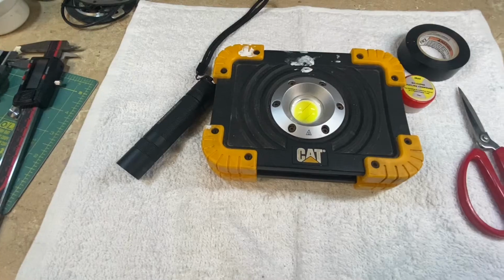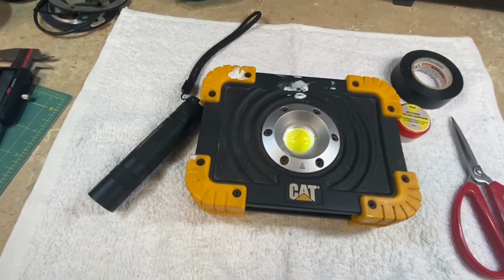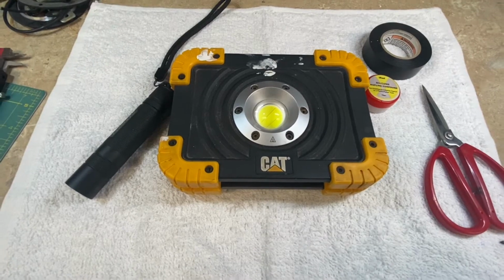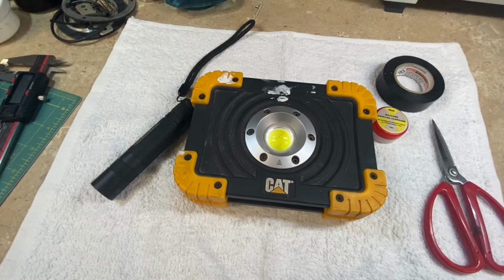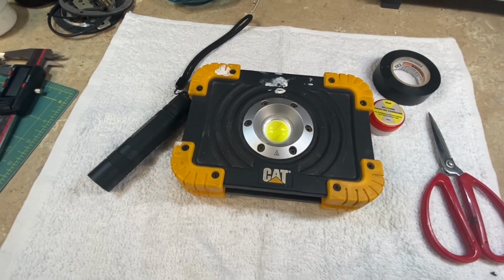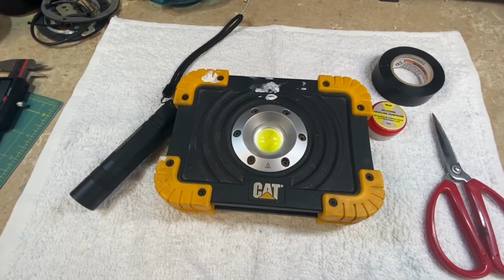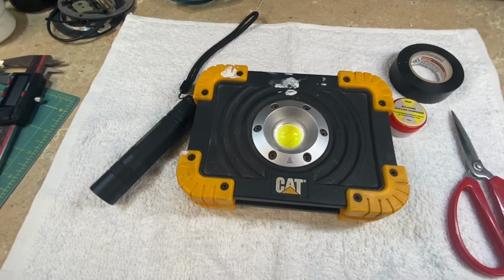When it came to the gamma spectra of the radium source, I did notice I had an issue when I dropped in the radium source. I should have been a little bit more scientific about it and actually placed it in there so the positioning could have been exactly the same each time. So the very first time I put that in, when I removed the PMT assembly, I realized that the disc had stopped probably about a ½ inch above the crystal on the PMT assembly. It kind of wedged itself between the lead insulating material and stopped there. So it wasn't directly against the crystal housing.